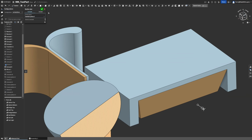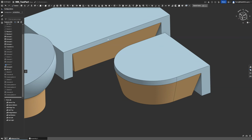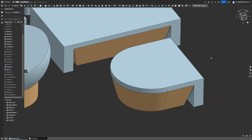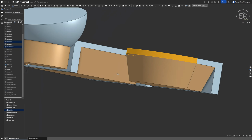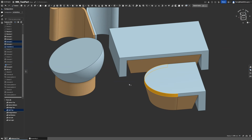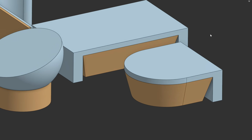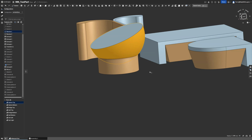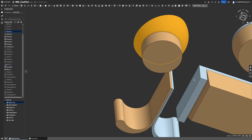Then a 13mm flat area with just one side anchored to the main material. What I've seen before with materials that only barely stuck to each other was that structures like this would start peeling and warping up. So I'm trying to see which combinations would show that behavior here. And yes, I know this looks like a toilet. Finally, a 15mm sphere that's completely embedded in the bottom material to check surface finish and separability.